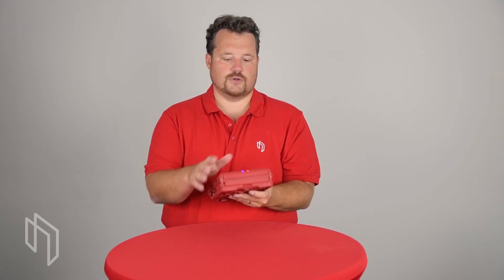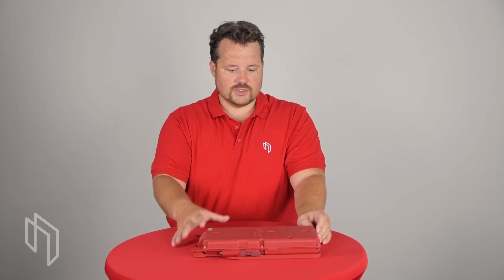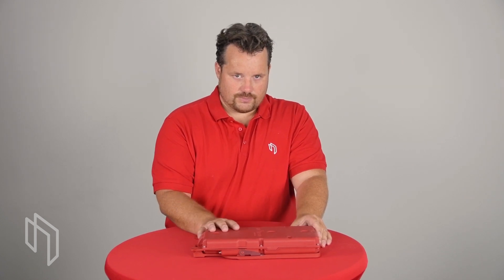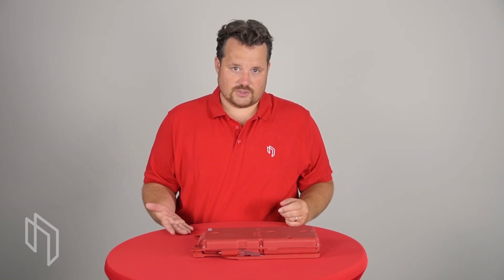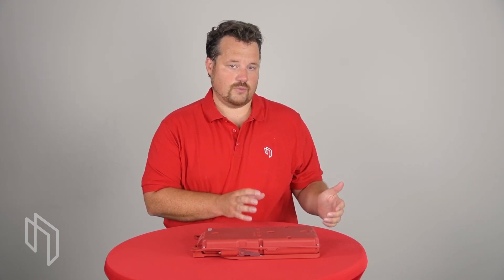The third way of shutting off the reader is by the orientation of the box — putting it flat on the ground or on a table tells the box to go into standby. This is especially important for charging overnight, because the box will always turn on when you apply power to it. If you charge it, it's always on, but you don't want the reader reading all night, as it may consume SIM card data reading unwanted tags. Charging performance is also slower when the reader is on.